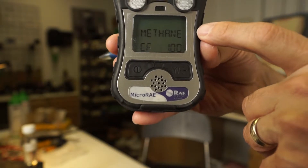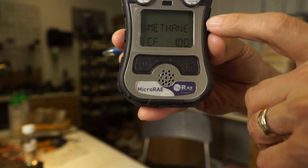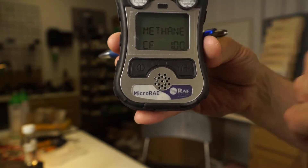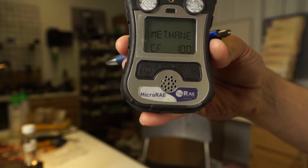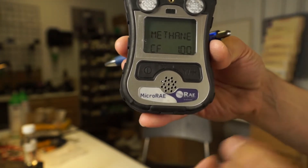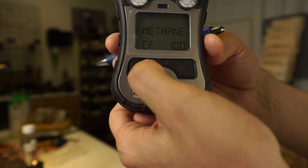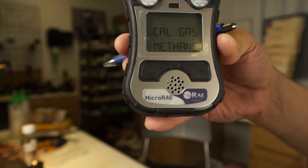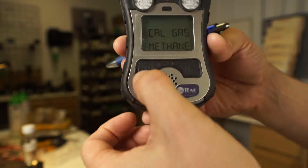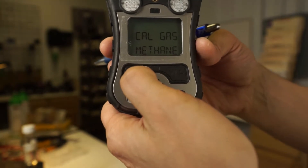The next screen, when I push the on-off button, is the indicator of what the instrument is calibrated to, and the correction factor — more importantly — that the LEL sensor is corrected to. You can see it's set up for methane, meaning the Tech Note 156 correction factor is valid when we see methane with a correction factor of 1. Cal gas is methane as well, so I can actually see what this instrument has been calibrated to.